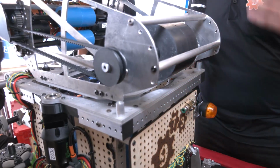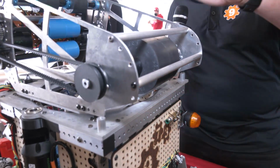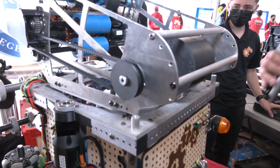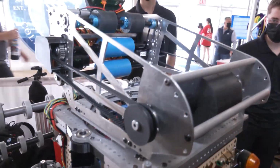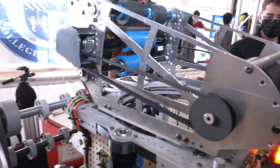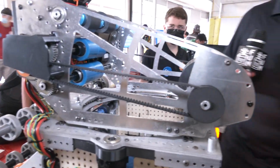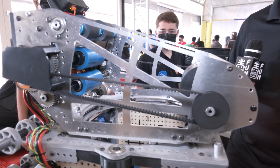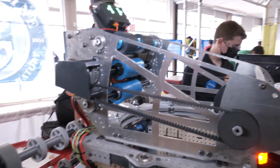We noticed that the ball was making contact with the front roller a lot sooner than the back rollers. We didn't like how that was interacting with the shot. It was giving us some unwanted backspin. So moving it forward that inch helped make our shot a bit more consistent. So that's the biggest change we've made to the robot shooter for this competition.